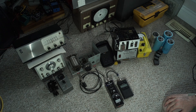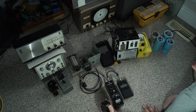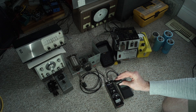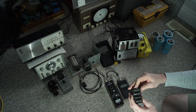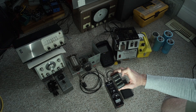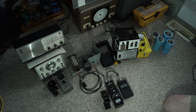I've been scouting around and came across a few things. Here I've got some — you're probably not going to see these too clearly — they're Marconi branded crystals, radio crystals. Three of the four are in the 40 meter band and one is in the 80 meter band: 3720, 7290, 7210, and 7060 — which is the one I really want, because I'm interested in CW, or Morse code. That falls right into the pocket.